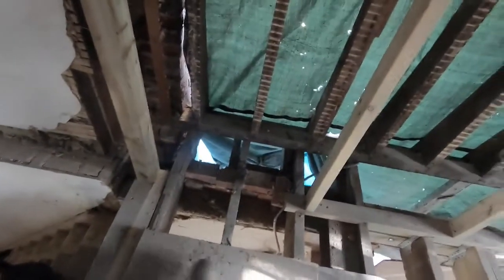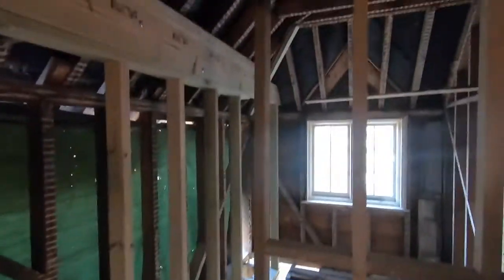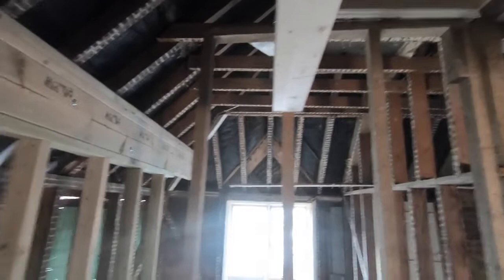And then the new stairs are going to come up there and sort of finish somewhere here, so you're right, we can tie in above that between the two steels as needed. Now that Purlin ends there. You were asking about, we're not having the lower ties now because that is not being vaulted anymore. So there's the end of the Purlin.